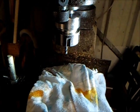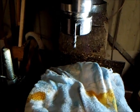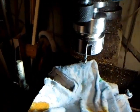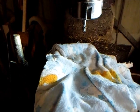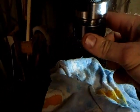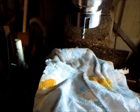Before I take my cutter out, here's a little tip. One of the worst things you can do when undoing your cutter is to let it drop down and hit the jaws of your vise, because these are hardened jaws and it'll just chip the edge of your cutter straight off. Then you've either got to send it out to resharpen or try resharpening it yourself, which isn't as good as an original. If you've got a nice tight collet that's fine, but if you're using a collet that's a size up, as soon as you pop the lock nut it'll just fall straight down and pop the edge off. Just stick a little rag under there and you won't wreck your tools.